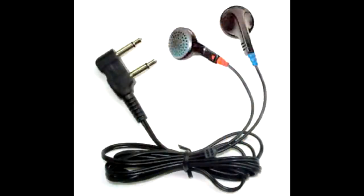How do you connect it to a standard device? In an airplane jack, each ear has its own independent double wire. Basically, it is two mono headphones paired together, unlike stereo headphones where one of the wires is shared by both speakers.